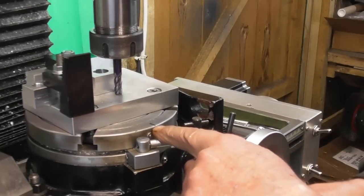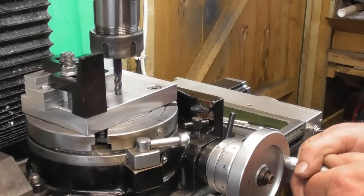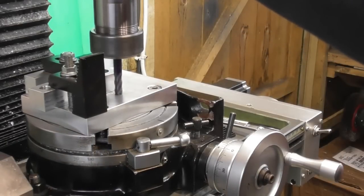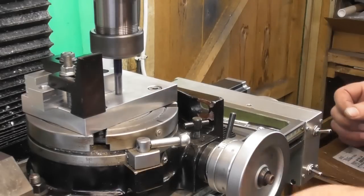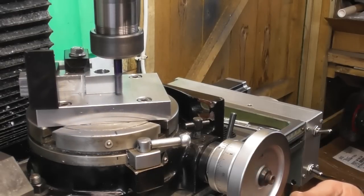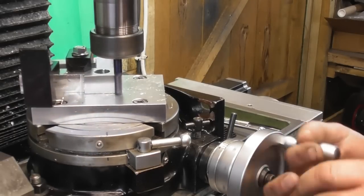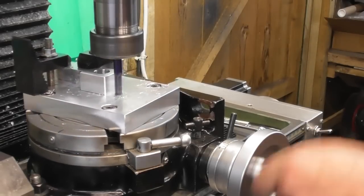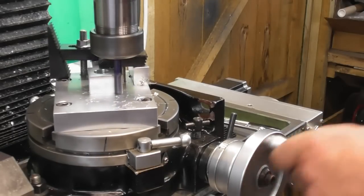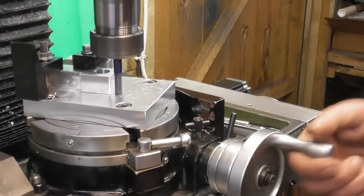And I've already given myself a mark of the 180, but it's not 180. It's 188, which is there. Okay. So, cutter is just long enough. I'll come around this corner and I'm going to put the cutter on using Y. So I'm just going to touch here. Here we are. Just touch that corner. There should be something similar when I come around to this one. Yeah, just touching it. That side is oversized, this side. Half a millimeter.